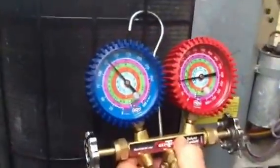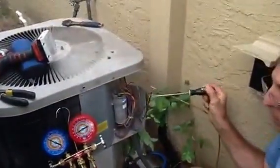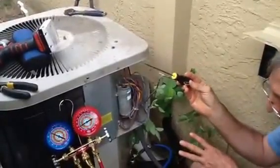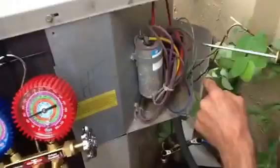Okay, that should be close enough. Watch the gauges. Now I'm going to take an insulated screwdriver and I'm going to push in the contactor. Do not do this with your finger — you really should wear gloves. Just be careful and watch where you're popping in. Power is on.